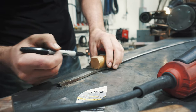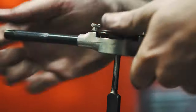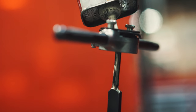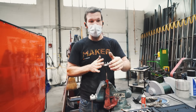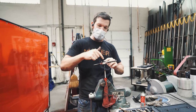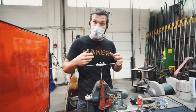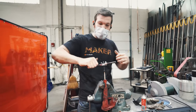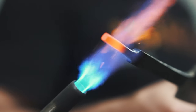Very clean — the edge is almost there, so I'm going to move on to the handle and I'm feeling really good. Right now I'm tapping the tang for the pommel to be screwed on. This wouldn't be possible if my tang wasn't softened — this is high carbon steel. If I had quenched all the way to the top of the tang and tempered it, this die would not have been able to cut the steel; I'd be worried about snapping the whole thing. That's why I heated up the tang to soften the steel so I can tap this end without breaking anything.